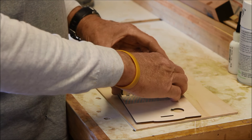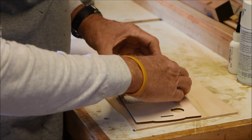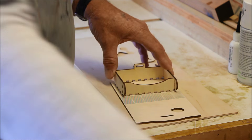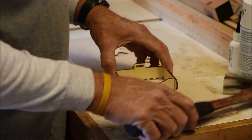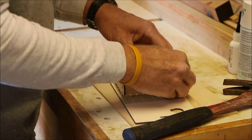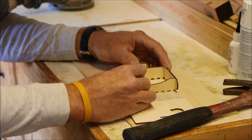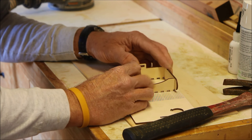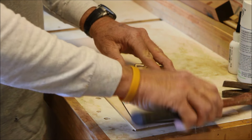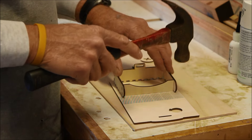Then you're just going to kind of line it up, make sure your corners are lined up. Taking a hammer, be kind of gentle because it is pretty thin wood. I've actually got my joints a little bit loose now so it's not cooperating. Just kind of hold pressure down and tap them into place. When you see one of your corners getting off, just kind of move it.